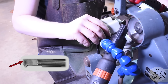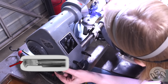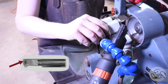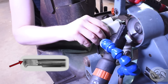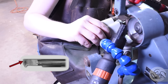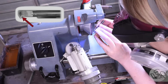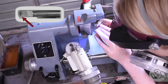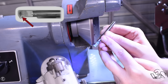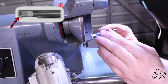Next, I move to the end clearance, making sure I've got a 10-degree angle under the end of the cutter so we can get in close to inside shoulders. I'm using magnification and lots of light — that's really key for these tiny grinding jobs. With magnification you can really see those lines and grind right up to them very precisely. I also wear a respirator for all grinding operations; a lot more dust is coming off than you think, and that's going to sit in your lungs forever.